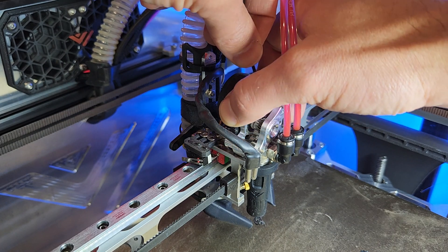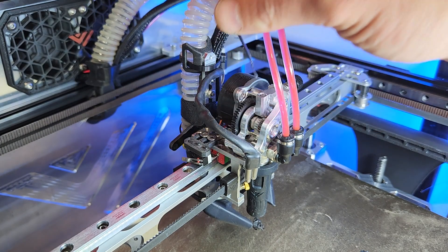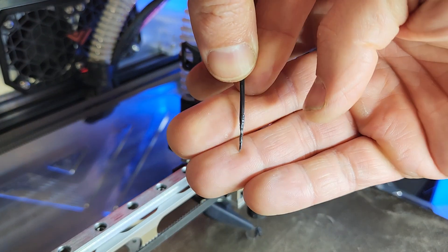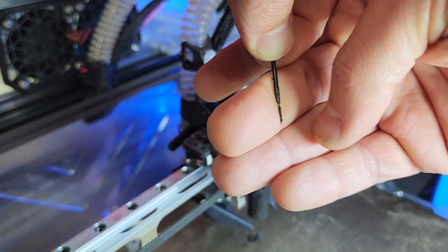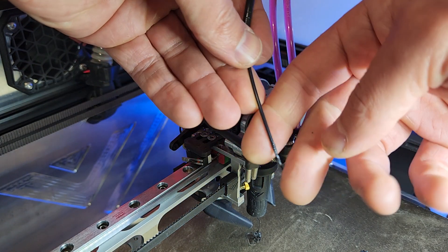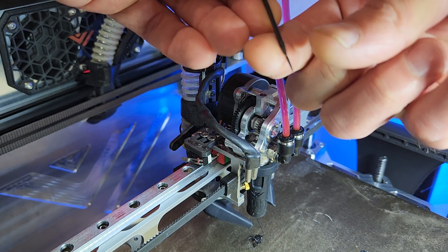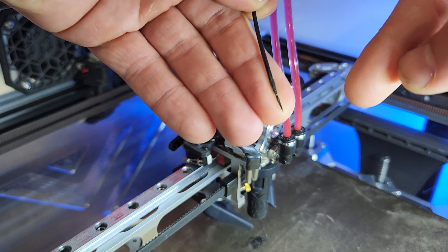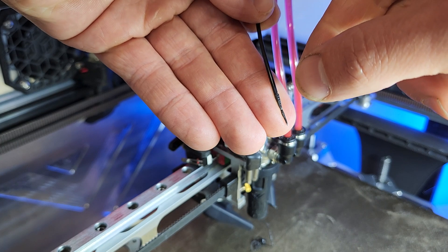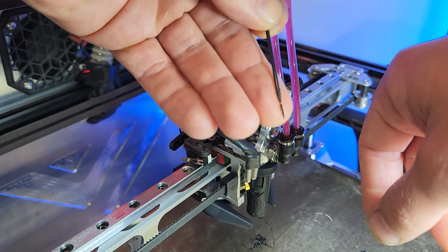What you do is simulate that tip shaping. I'm going to feed it, do that a couple of times, and then it just comes out perfectly. As you can see, the filament is shaped in a way that there are no bulbs, nothing — it goes straight out. If you have too much tension, when you unload, this part will still be soft and get squished and squeezed between those two gears, deforming and expanding wider than 2 millimeters in diameter — and then it won't fit in the hole.